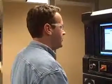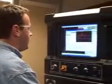I also need to make sure that everything is set for what I have on the table. I do have an aluminum piece, but it's not a 1/4 inch. We're actually going to be cutting through 2 inches of material, so I need to have that set. I'm happy with my tool offset, and I'm also going to enable tilt, courtesy of our Tilt-A-Jet accessory, which will remove taper from the part. So with everything in place, I'm ready to go.